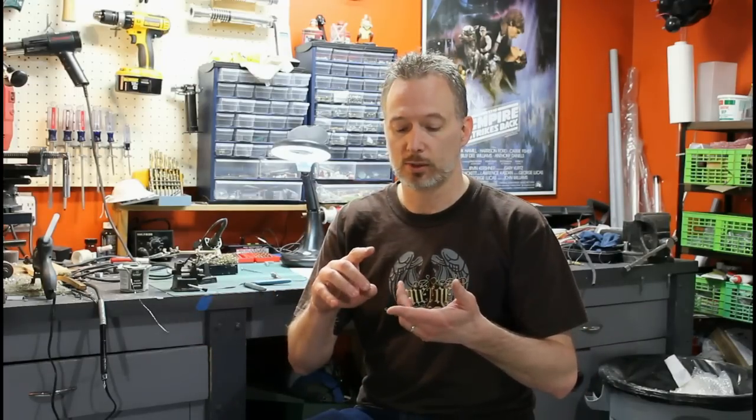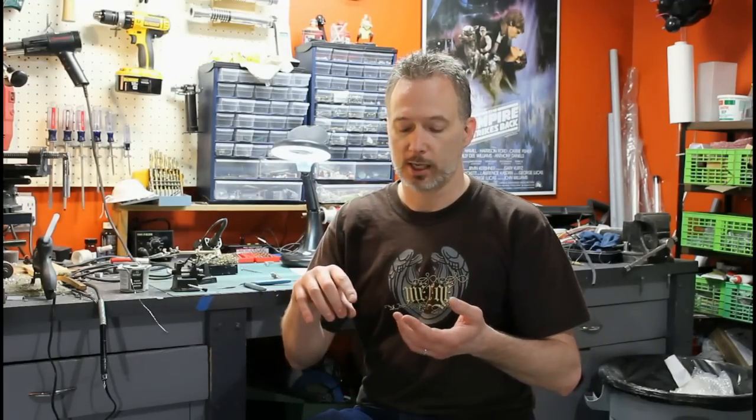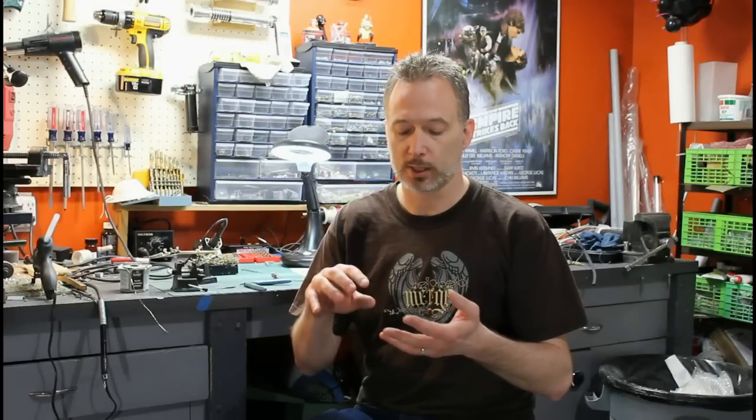So there you have it — that's how to wire up a multi-die LED, whether it's a Tri-Cree, a Tri-Rebel, or an LED Engine. There are still things to learn as new LEDs come out like the quads, but this will get you started: learn the specifications for your LED and how to wire it up so it works with both your main blade color and your flash on clash color. Until next time, thanks for watching.